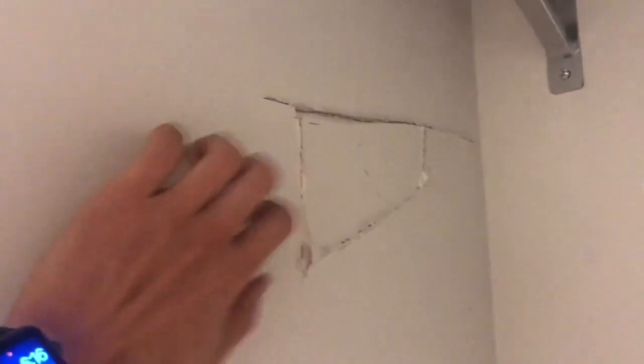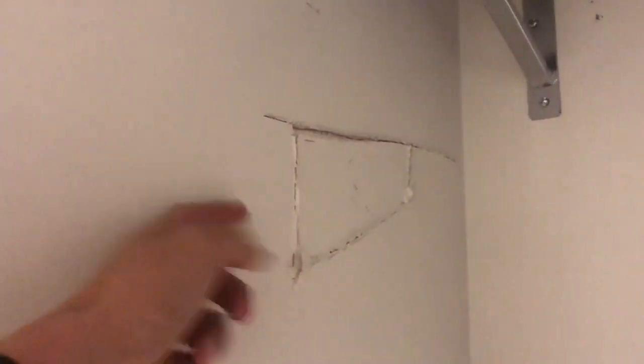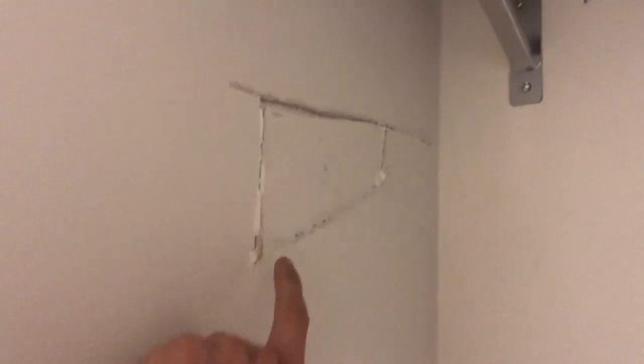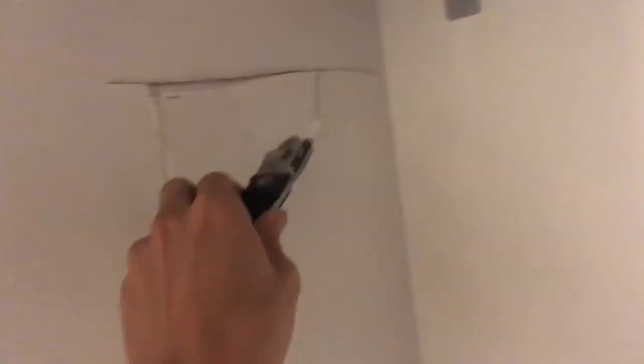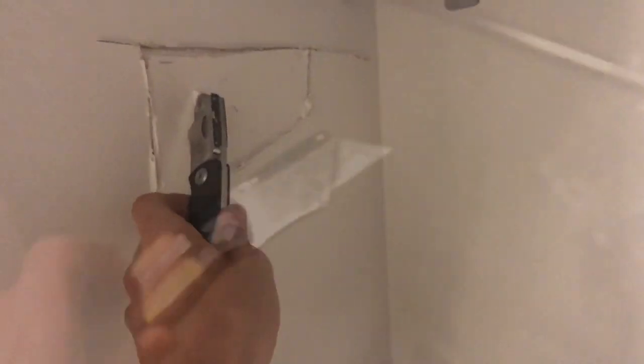A little change of plans, guys. This is drywall. Part of the house is drywall and part of the house is plaster. Older houses have plaster. This one happens to have drywall — I lucked out. So I'm able to just score that over and over with this blade. And I'm actually just cutting — the entire safe is going to go in here. But I'm just planning by cutting this out to see where the studs are. And after I remove this, I'll show you. So I'm still scoring with this blade.